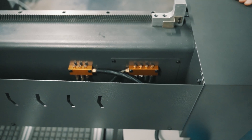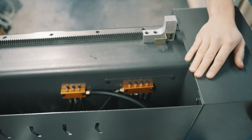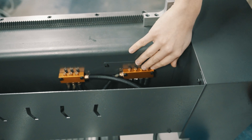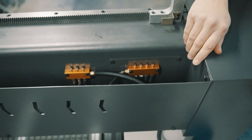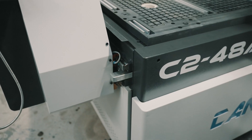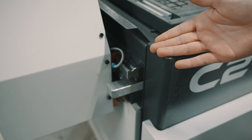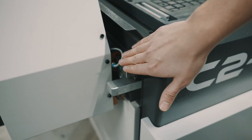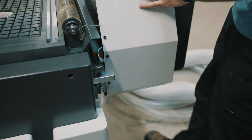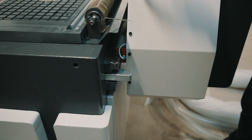Just above the grease pump we have our first intersection of tubes. All of these connect to our rails and linear guides and they spread out between both manifolds. Our first set of grease lines connect here to our linear guides on our y-axis. There are some at the front and also some at the back. On the right side of the gantry there are the same linear guides on the front and the back as well.